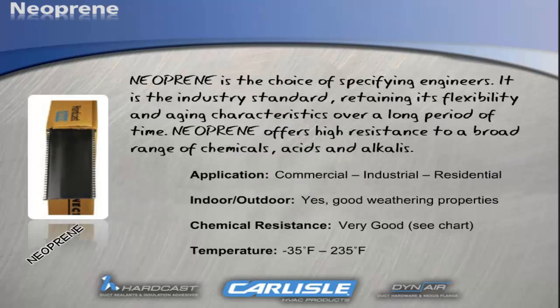Neoprene connector is the choice of specifying engineers. It's the industry standard, retaining its flexibility and aging characteristics over a long period of time. Neoprene offers high resistance to a broad range of chemicals, acids, and alkalis. The application for neoprene connector can be commercial, industrial, or residential. The product can be used indoors or outdoors because neoprene does have good weathering properties. Chemical resistance is also very good, and the temperature range is from -35 to 235 degrees F.